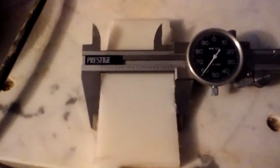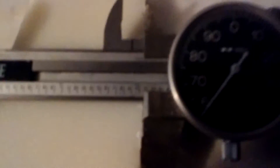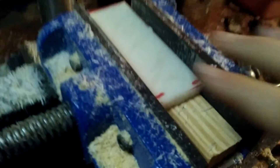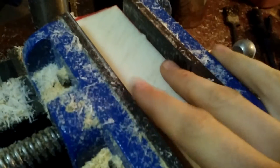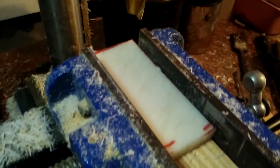Okay, so now we're actually getting somewhere. Remember the measurement is supposed to be 1.7, so we've got quite a bit of hogging to do to get there — a lot of end milling. Now I've actually got both sides trued up, not to the exact measurement yet — I'll do that in a minute — but I want to get these ends here trued up and to the correct measurement while I've got it set up in the vise, taking off as little as possible.